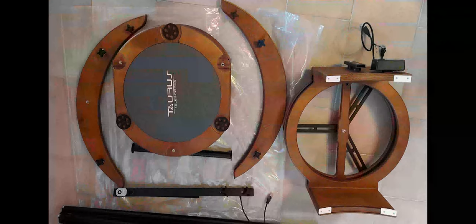Altitude movement is performed thanks to arc-shaped bearings with teflon sliders that go on the sides of the primary mirror assembly and are reinforced with a horizontal bar at the other end. The most important part of a reflector telescope is, of course, the primary mirror. This sits in a wooden and aluminum alloy structure, floating on top of nine adjustment points in the back. A very handy feature is that the three collimation screws are accessible from the top of the assembly.